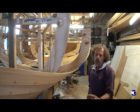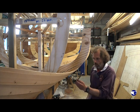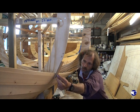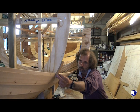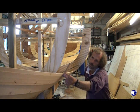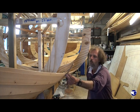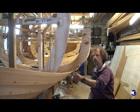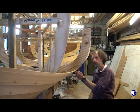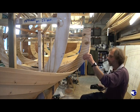Another way you can check is by putting a scrap of timber and pushing it against the bevel, then drawing it along the plank. It's lining up with that mould — it should come back without too many lumps and wobbles; it should come back smoothly, opening out all the time until it comes back and lands on that mould. That's what we're aiming for.